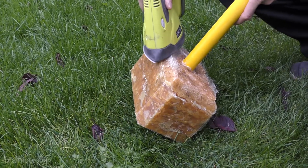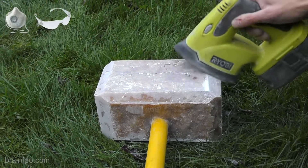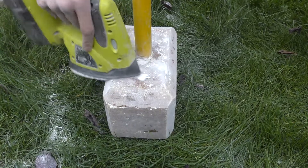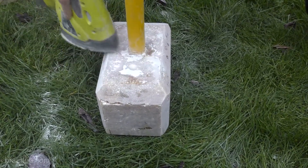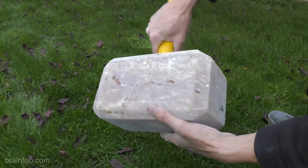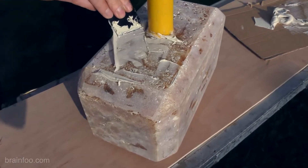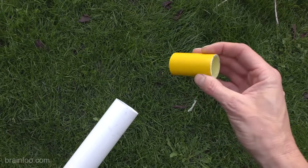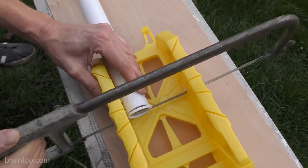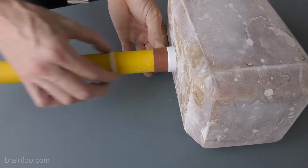To get everything looking as it should, I'm going in with 40-to-60 grade grit paper. Whenever you sand anything, let alone glass fiber, you need a good quality breathing mask, preferably some disposable paper overalls, and the wind blowing away from you. Any angles that were too fiddly to make in the mold can now be sanded into place. Any last imperfections get a very thin layer of standard car filler like bondo, and after drying and sanding with 400 grit we tackle the handle. Some solvent weld pipe fits nice and snug right over the fiberglass handle — bonus.